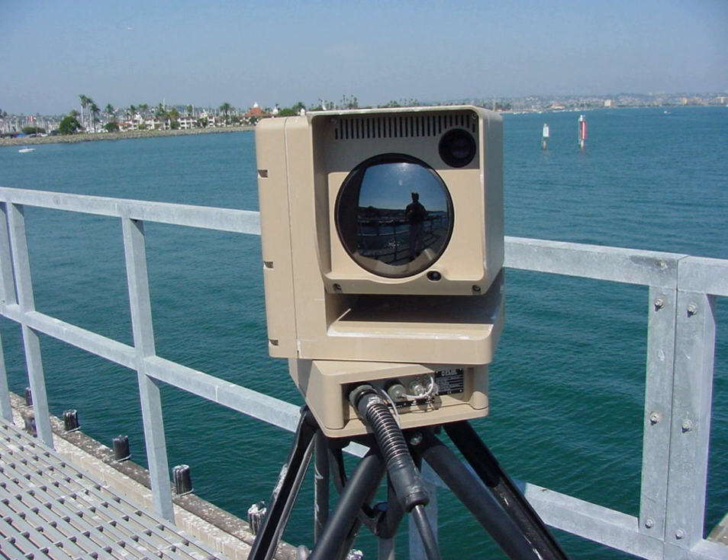In this example the bottom layer consists of a silicon substrate and a readout integrated circuit (ROIC). Electrical contacts are deposited and then selectively etched away. A reflector, for example a titanium mirror, is created beneath the IR absorbing material. Since some light is able to pass through the absorbing layer, the reflector redirects this light back up to ensure the greatest possible absorption, hence allowing a stronger signal to be produced. Next, a sacrificial layer is deposited so that later in the process a gap can be created to thermally isolate the IR absorbing material from the ROIC.